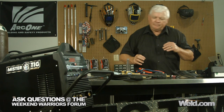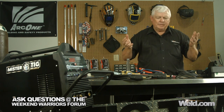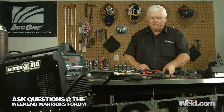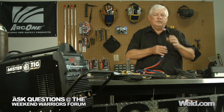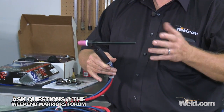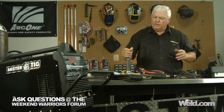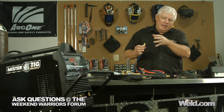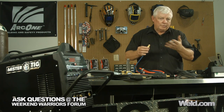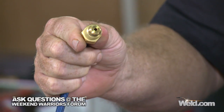Secondly, in almost every case, most of the import machines we've found — the TIG torches are just absolutely horrible. Not just bad, but horrible. So we will put on a top-notch TIG torch — this happens to be a 300 amp CK flex head. A couple of things to be aware of: we have a water cooler on here, and this has threads from the old-style water coolers where you used to have to screw this on.